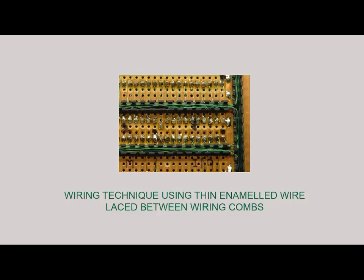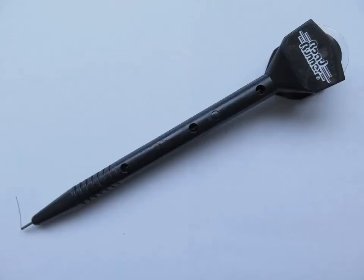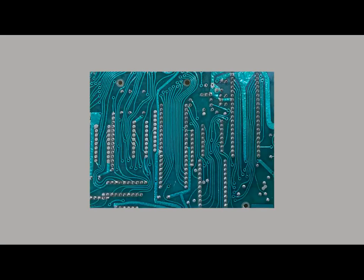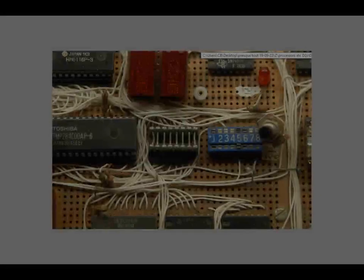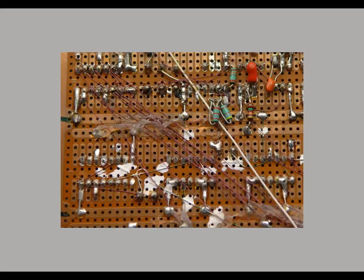How one actually makes a circuit is up to the individual. I personally use Vero strip board, glue on multiple wiring combs, and route very thin wire from pin to pin via a wiring pen. In my opinion, using a printed circuit board doesn't seem such a good idea because it's a lot of hard work and could well need alterations after the device has been built. The Z80 computer shown in our next video was in fact the second Z80 project I ever attempted — the first was designed all wrong and never worked. My second attempt used several different wiring methods, and it shows. Some parts were wired using thin white PTFE-covered wire on both front and back of the board, while other parts used very thin enameled wire just on the back, glued on with everything from Tipp-Ex to silicone rubber. In other words it still looks a real mess — but I learnt a lot constructing it and it still works today.